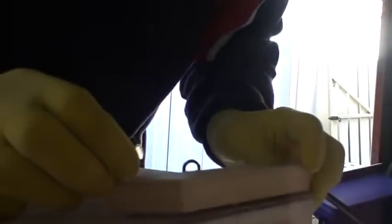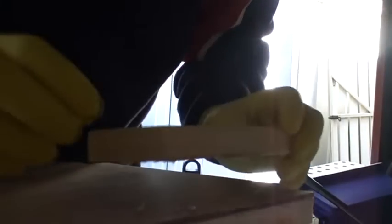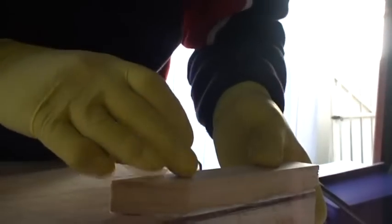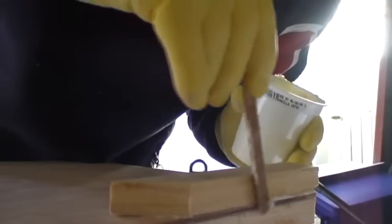So this piece goes down on here. There are a couple of marks where the heads of my nails are — I can just feel it locked into place and actually squeeze that down. You can see the squeeze-out coming out around my piece. It's important with epoxy that you don't put too much pressure and squeeze all the glue out. Epoxy is a joint-filling glue, so you actually need some in the joint between your pieces. With other glues you need high clamping pressure, but with epoxy you can actually weaken the joint by squeezing it too hard and squeezing all the epoxy out of the joint.